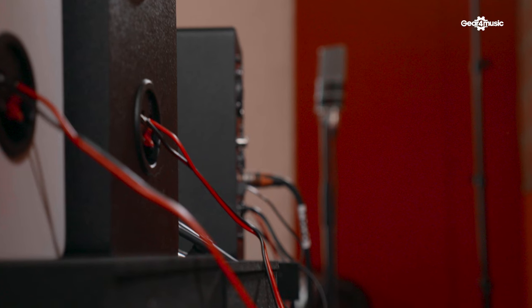In terms of how they're configured, one of them features an amplifier, and one of them is the slave monitor, which is where they differ from the current HS series, the HS5, 7 and 8, which are all housed with their own amplifier. This makes them a lot more lightweight and portable, so they can be really useful in compact studios, but also very good for portable solutions where you need to be moving from one situation to another. Audio-wise, they still maintain the HS philosophy of consistent, clear sound right across the frequency spectrum. And because of the smaller woofers, they don't go quite as low as the HS5, 7 and 8, but they still give you a nice, solid, full frequency response.